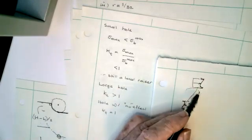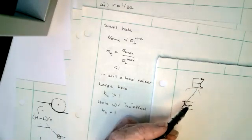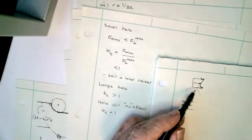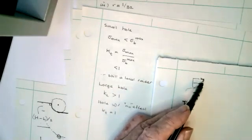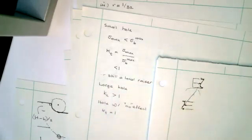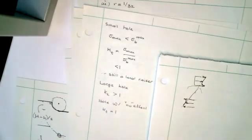If you drill out this material from, say, the side beam of a chassis, which is under bending, then what you've done is you've increased the stresses locally, but you've made them no worse than the stress you're designing for on the outside, and you've just reduced the weight. So let's go and see if we can estimate when that's going to occur.